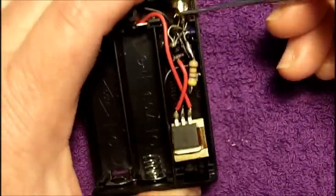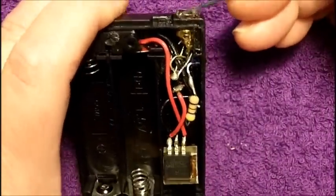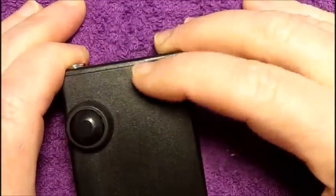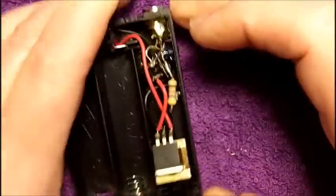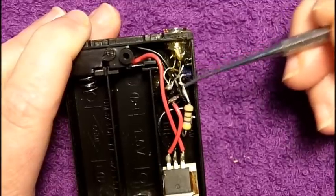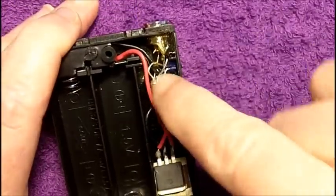So we've got components not stuck down, we've got bare wires all shorted together up here. And then to top it all off, the atomizer connector isn't straight — if I put an atomizer or cartomizer in here it's going to tilt off to the side. That's just aesthetics. I also don't like the use of these really small switches in these things, because that switch is not rated for the amperage — not rated for three amps. Super bad mod. You see bare wires like this: close it back up, contact the modder, get your money back.